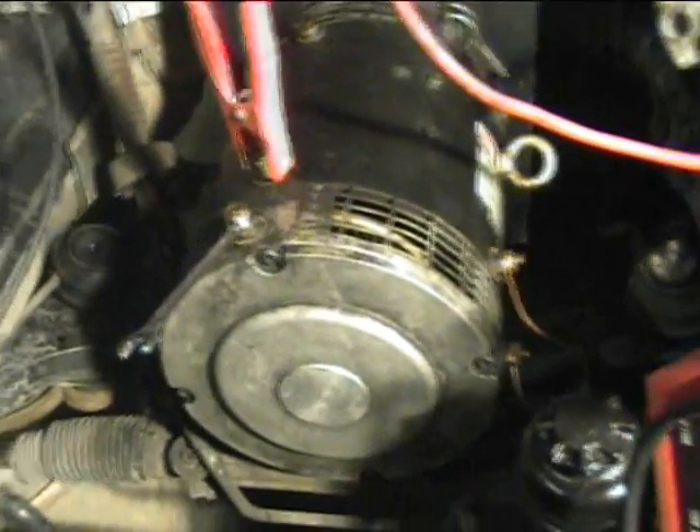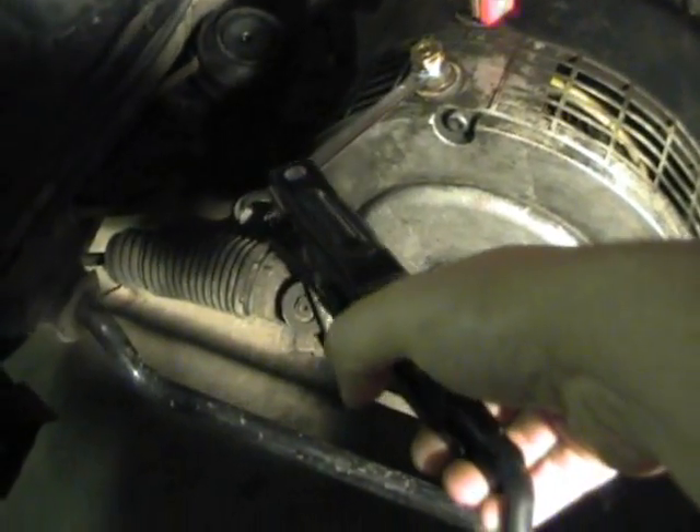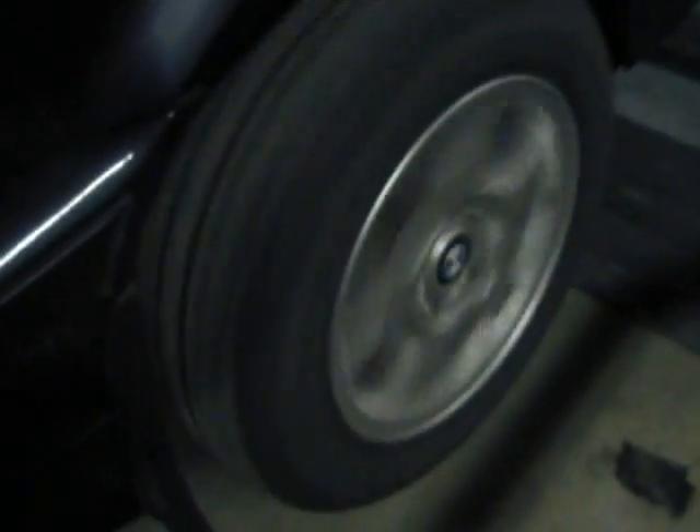Again, we'll go for third gear. You can see our wheels are spinning a lot faster now. And there should be a limited slip differential in this car, so we should see the two wheels turning — which we are. And thankfully, there's no sounds coming out of the brake drums, so at least the brakes haven't seized on.